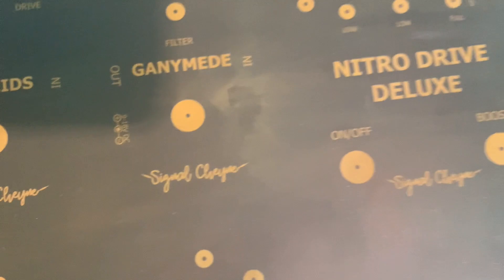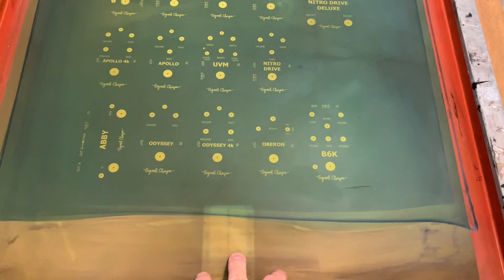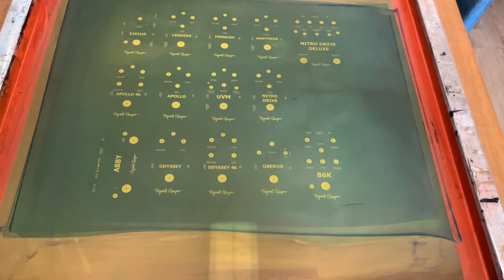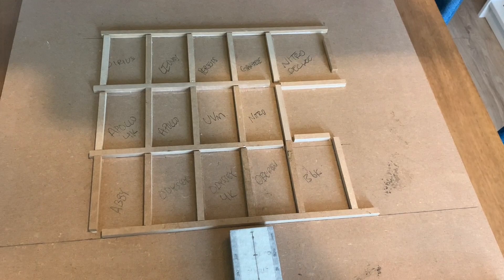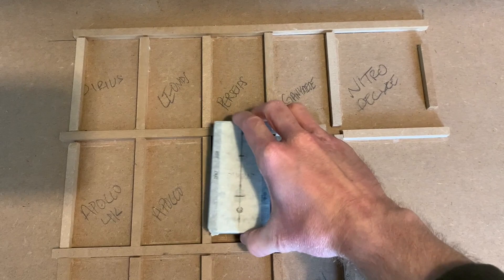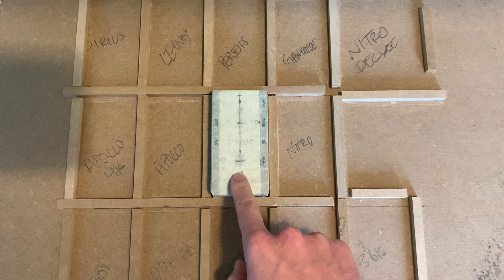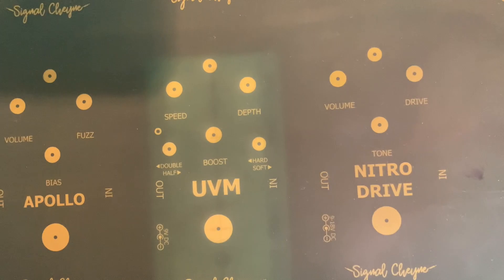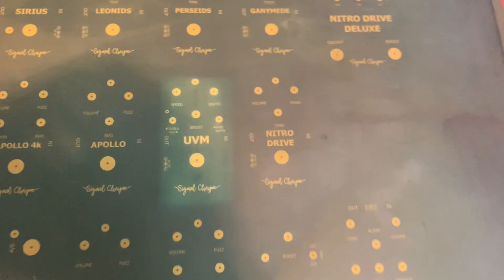On the wet/dry font here, it's very small, and on my logo, everything will get really crisp. You have to have the screen made, and you do that with either Illustrator or Inkscape, something that can give you an SVG file — a vectorized file. I first made the mistake of doing it in GIMP, so it wasn't vectorized and I had to redo the whole thing. On the jig, I made a little space for each pedal so the housing sits in there and won't move. I've marked out exactly where to line up the cross and the line, and everything is lined up.